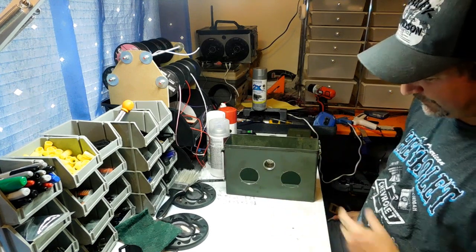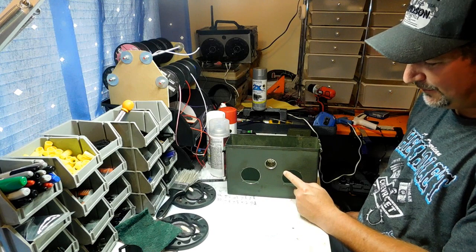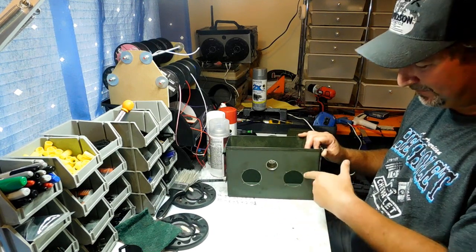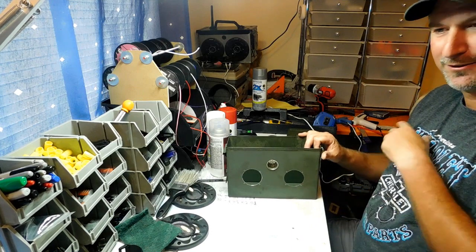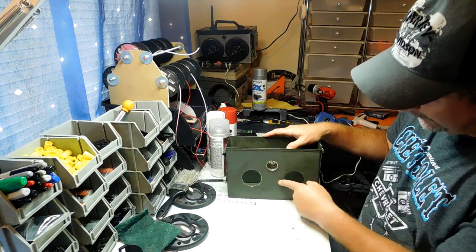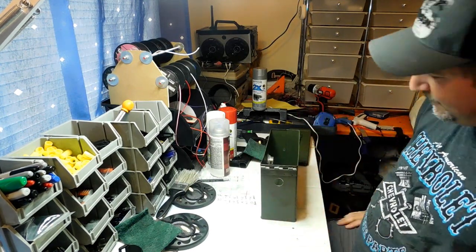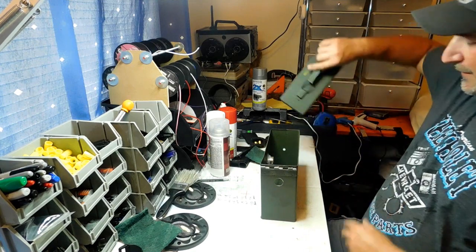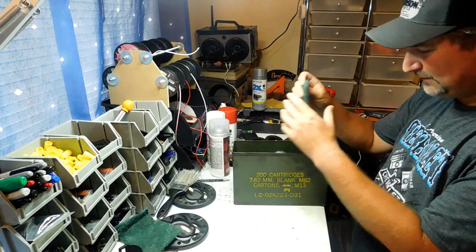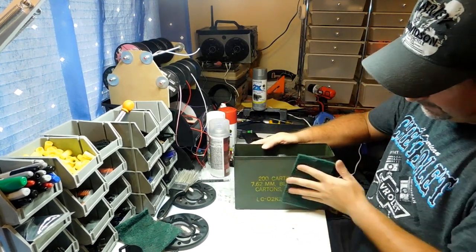The other thing is, if you're drilling, especially your pilot holes here for your speakers, I learned the hard way one day. I was pre-drilling some holes after I had painted. The drill slipped and actually scratched the paint, and I had to start all over. It ruined the project. So even your holes for your screws, go ahead and do all your pre-drilling, your switches, your vents, whatever you have. And if you're going to drill in the lid, go ahead and do that. Get all your drilling done first before you do your paint.